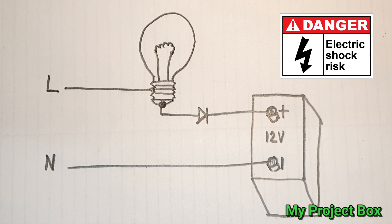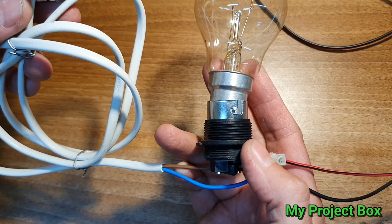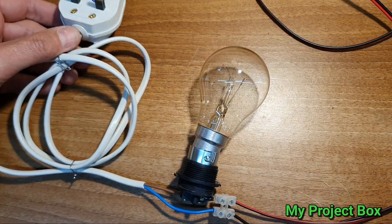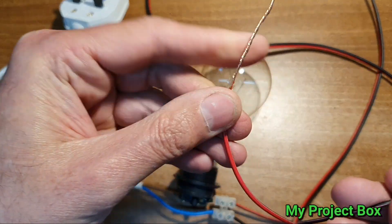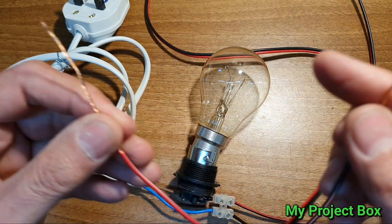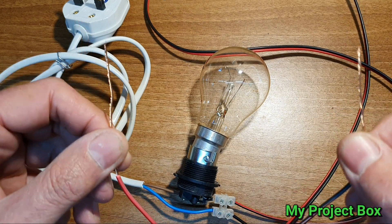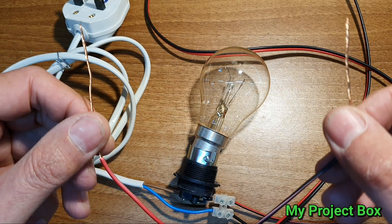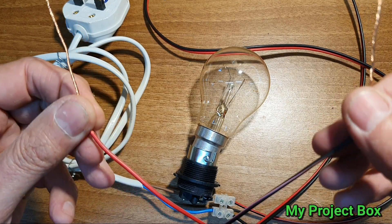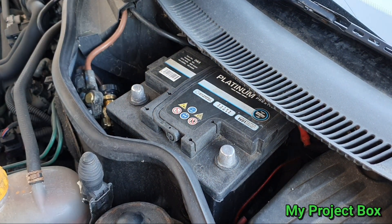Of course this must be considered live everywhere in the circuit, so you cannot touch the battery terminals until the live is disconnected. This can only be used in an emergency. The neutral goes straight through to the negative of the battery, the live goes through the light bulb then through a diode generating the positive to charge the battery, current limited by the light bulb. Preferably, take this battery out of the car and put it somewhere safe where nobody can touch it.